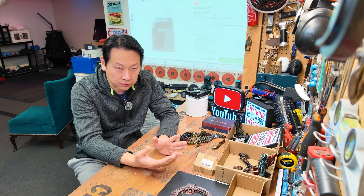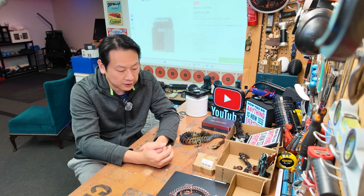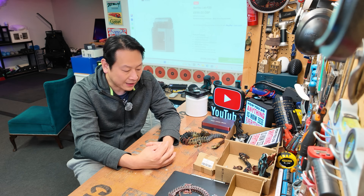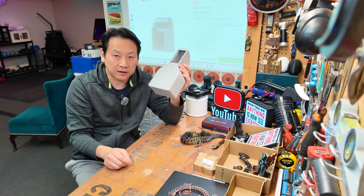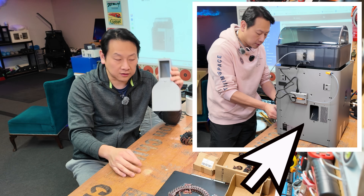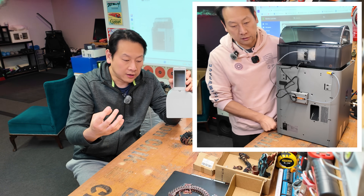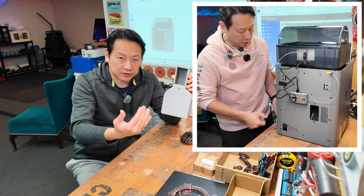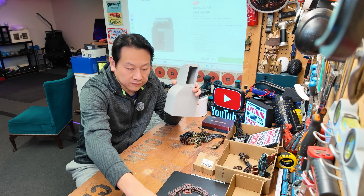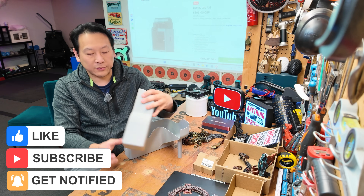The next thing I don't like is the smell — it is melted plastic in my studio where I don't usually open windows. After leaving it to print overnight, in the morning I can smell the plastic. That's why I'm choosing to use a poop bin like this one, which actually closes it off. There are two ports at the back of the machine: one exhaust port and one poop chute — which is just an open hole. If the machine is drawing air from outside to cool the PLA, the gas has to come out from either the filter or any opening, even the gaps between the doors. So instead of leaving the poop chute open, I'm using one that closes it.